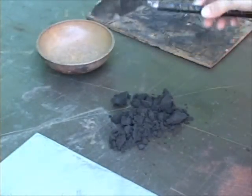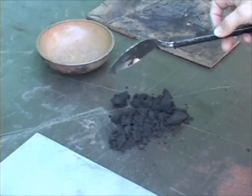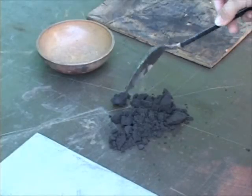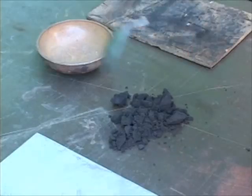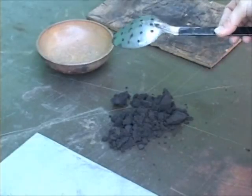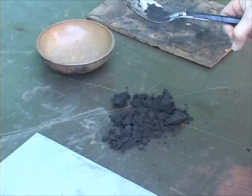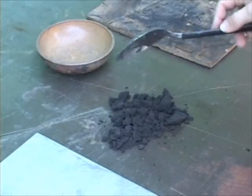The reason I use silica sand is that it comes from natural glacial erosion, so the particles are actually round — they look a little bit like irregular shaped marbles. Because there are four different sizes, it packs really tightly. If you imagine a jar full of large marbles there would be lots of spaces, but several different sizes would pack much tighter. Lots of metal foundries use olivine sand, which has more of a square particle shape resembling a sugar cube rather than a marble, but I prefer the silica sand — it packs a little bit better for my use.